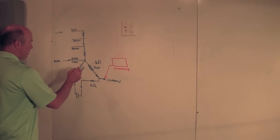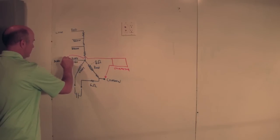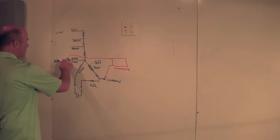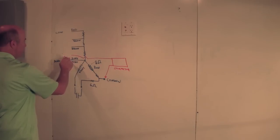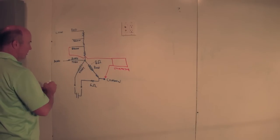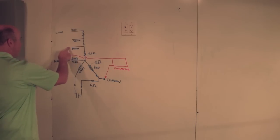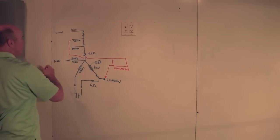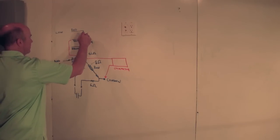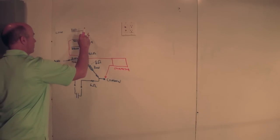So basically I take the wire, route it around like this and connect to here, so I get 3 ohms. If I do the same thing and move that wire over to one of my other colored wires coming out of the motor, I get something like 4.1 ohms on this one. I keep moving up the chain here, maybe 5.4, and then the last one, if I took another measurement, is maybe 6.1.